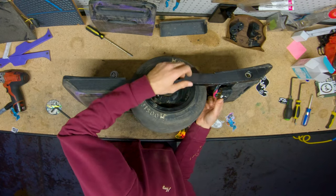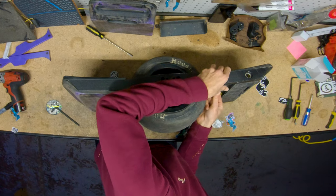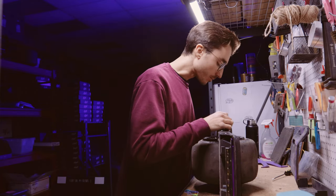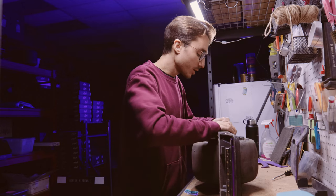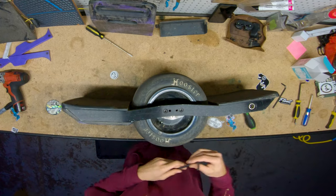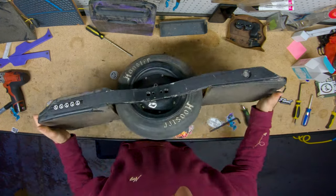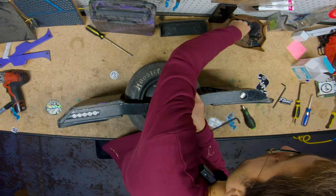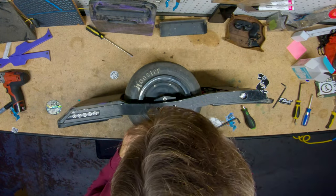At this point you can also plug the connector back into the controller box. Then take your original outer hub bolts and bolt them back through the rails. I like to install all four of them relatively tight before really cranking down on any one of them.